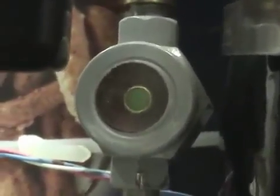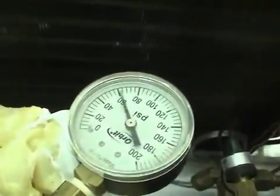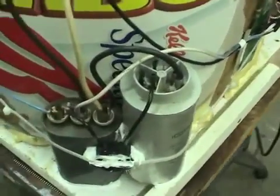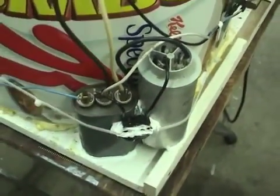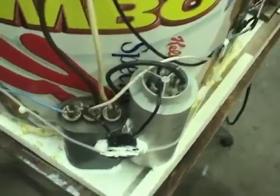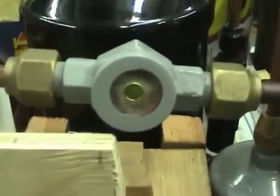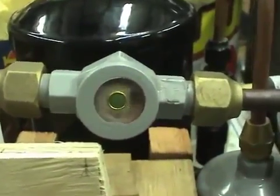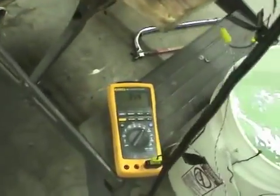Discharge, liquid discharge. The gauge is stabilizing. I've got an extra capacitor in parallel to the original one through a PTC to turn it off once the device has started. I found that for some reason this has trouble starting after it's been running for a while at high temperature, and this helps a bit. It takes a few minutes for the liquid suction line to clear out, but after about 5 to 10 minutes it's all dry in the sight glass. The temperature is starting to go up — half a degree already.